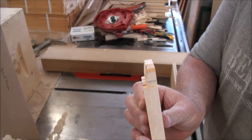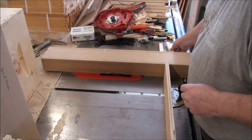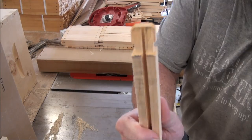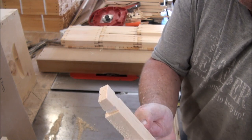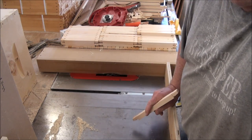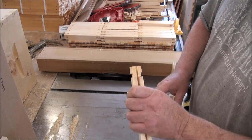That's exactly right — that made that bevel absolutely perfectly. I think I have one more cut I want to make on these. They have a nice little bevel on the end; I like that. I'm not sure it's necessary, but it looks very nice instead of a square end. That looks like a 45 degree, so basically what I need to do is continue tilting my blade up to 45 and run these through twice.